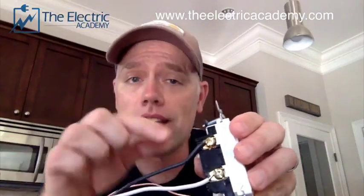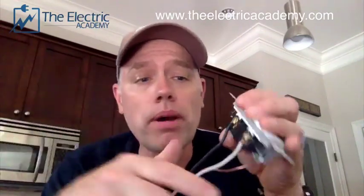Here's what to watch for: this neutral is a bit too long - just a hair. The hot looks pretty good. I like to see the wire come under the screw head a little more. But the key thing is I can see the connections, and to me that is key - I can feel safe that I've made a good connection. The more you do these, the quicker you get, and you can come pretty close to the speed of guys who backstab. I'll say it - the backstabbing thing is kind of lazy. You've got to hook the ground anyway, so what are two more hooks? Get in the habit of it.